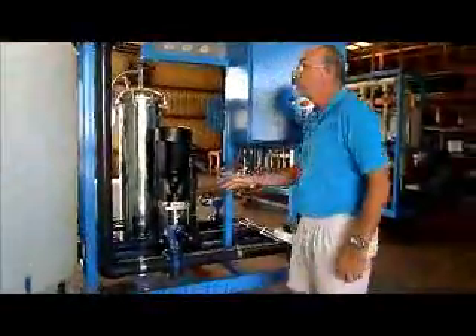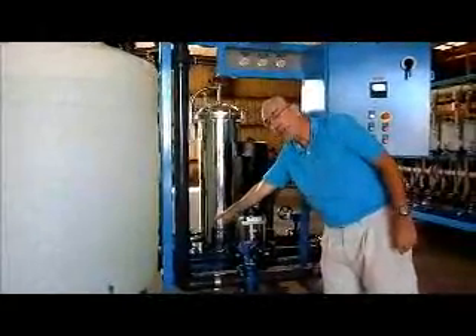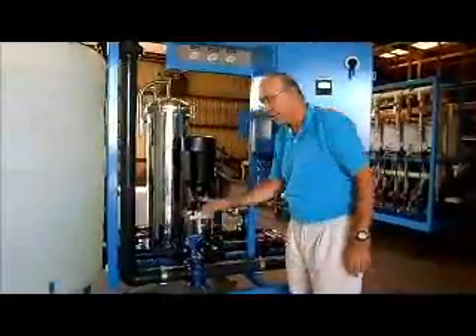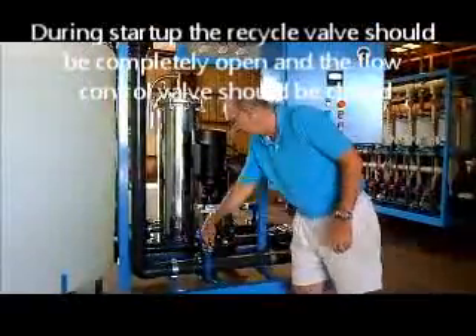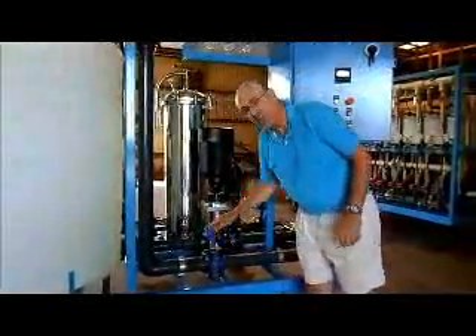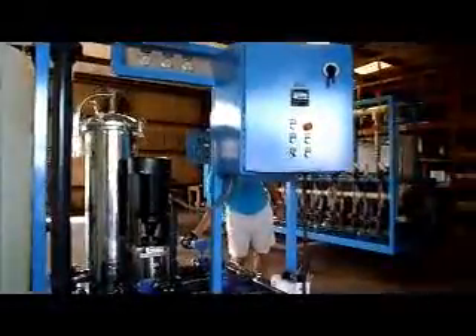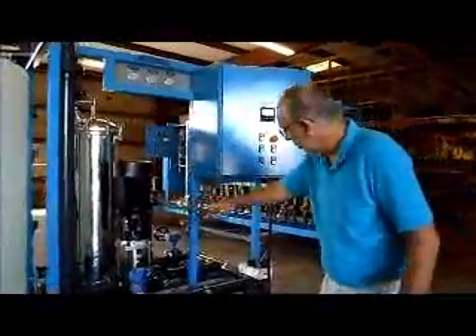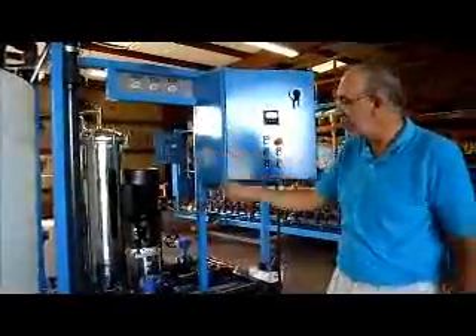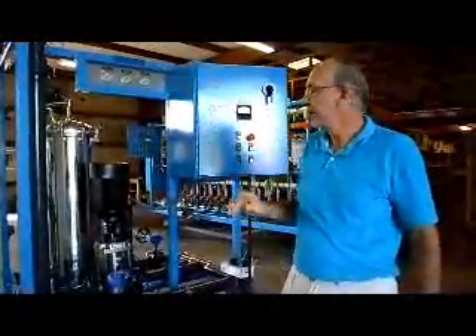Let's review normal operating mode. The two valves on top are open. The exit valve is open. The suction valve into the pump is open. These two valves are adjusted. At startup, open the recycle valve completely and close the flow control valve completely. The reason we do that is because we want to mix our chemicals up — by just recirculating through the tank we mix the chemicals and make sure everything is working okay before we start pumping solution out to the RO skid.